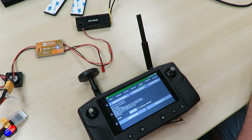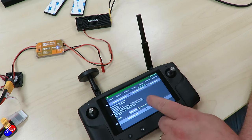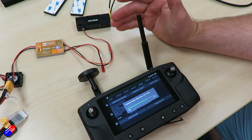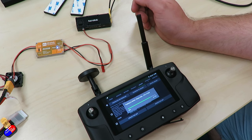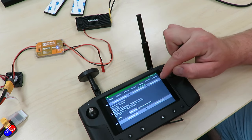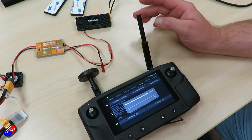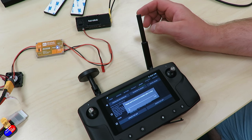Download — that was fast. Now we transfer to the air unit; this sends the firmware across and it will be fairly quick as well. This looks like a small incremental update. So we're now transferring the firmware to the air unit. Then the critical bit is the next step where we actually perform the update — it will write the new firmware and power cycle. It's very important during this next step that we don't interrupt the power connector. That looks to have transferred the firmware. The final step is now update — we'll get a little warning saying allow five minutes, though it will be quicker than that. This is the installation and then the rebooting of the air unit to put the latest firmware on.